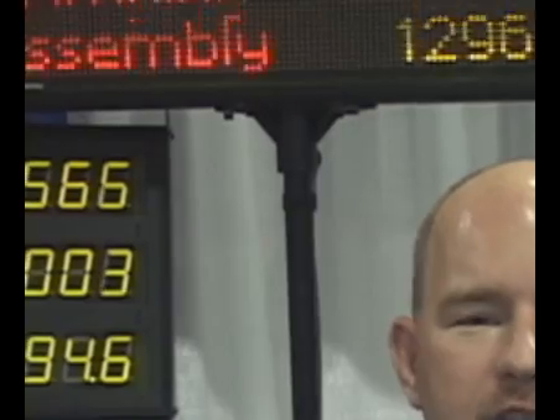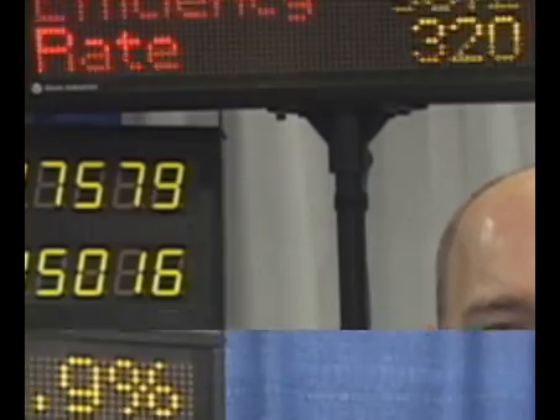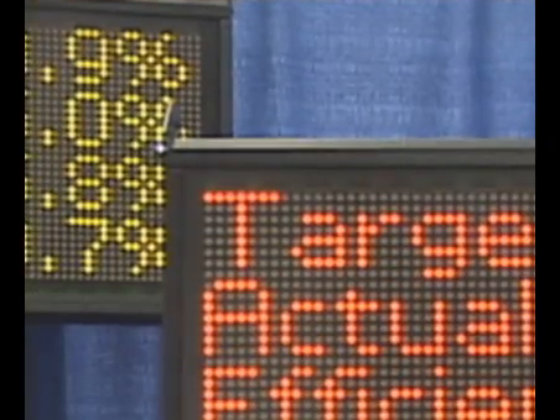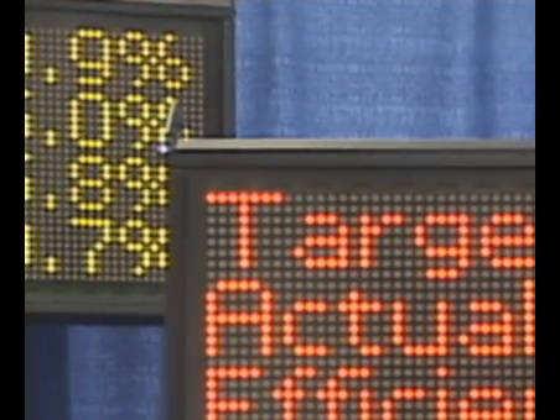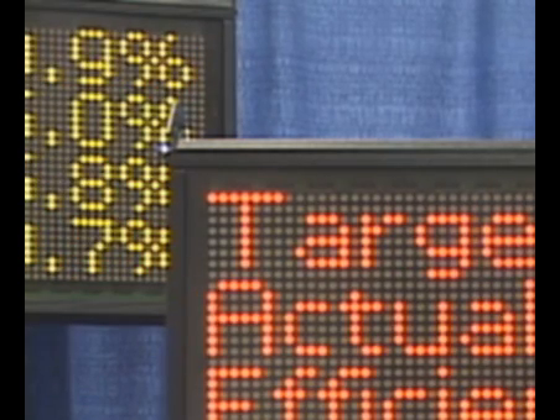Hi, I'm Adam Moran here at National Manufacturing Week with Vorne Industries, and we're displaying our bolt-on productivity monitors to the audience here. This is our Vorne XL800 production monitor. This is a device that combines real-time production monitoring with a large visual display and embedded web server. We're feeding a discrete I/O right off of a production line and calculating real-time data for your associates on the plant floor and through an embedded web server throughout the organization.